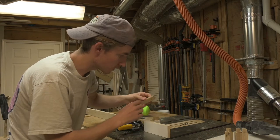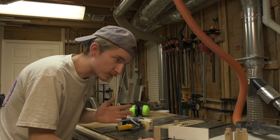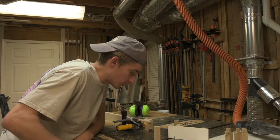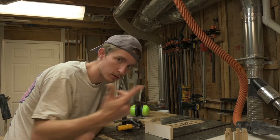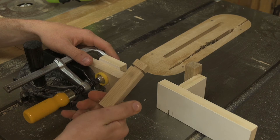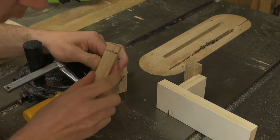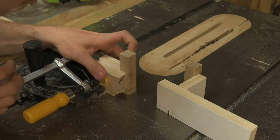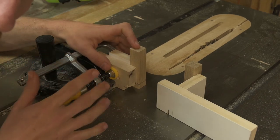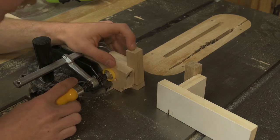I decided to make a little jig so I can cut the tenons vertically to save time, because I have eight of these to do with four sides each — that adds up to a lot of time. I quickly threw this thing together. Here's how it works: I take the piece with the shoulder cut done, set the stop block to cut just that little bit off the depth of the tenon — about an eighth of an inch — and stand it up. Without this jig I'd have to keep my fingers too close to the blade, and since it's not on a sled, if it grabs at all it can tilt. That's definitely dangerous.